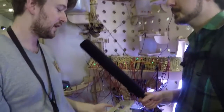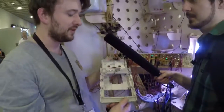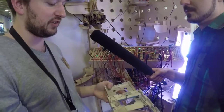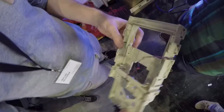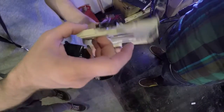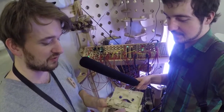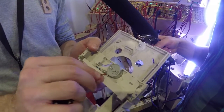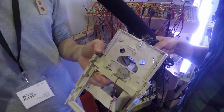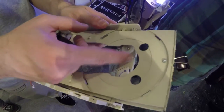What I have here is the inside of a CD-ROM drive. If you take out all the electronics, you're left with a really cool mechanical device designed just to move in one direction, with all the mechanical parts you need, and it's really cheap to get. There is usually a DC motor, which has two wires. One polarity makes it rotate fast in one direction; the opposite polarity makes it go the other direction. There's also gearing to convert the fast rotation into slower movement.